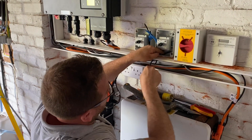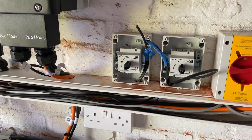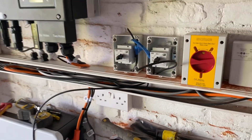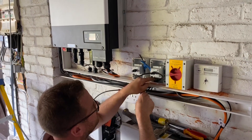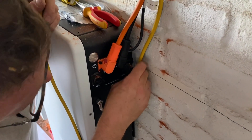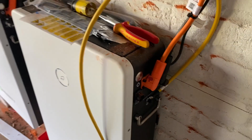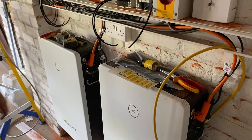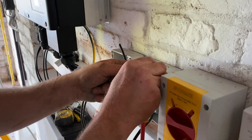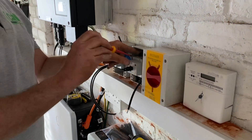We've had some fun pulling the strings in and they're routed around into the roof space. You've brought the two sets down here for the isolator. We've got to identify which one's positive and which one's negative — we're going to test them to get the correct polarity, and then from the isolator we go into the GrowWatt. There's a juicy earth connection there — we've just got to earth the batteries down, because they're all class one, making sure everything's earthed correctly and linking both together to the inverter. The strings are single core 6mm, and obviously we need to be able to isolate them — for maintenance and in case of emergency, we can isolate from here to make safe.